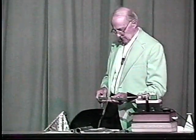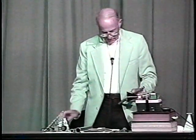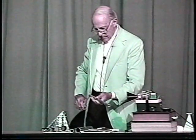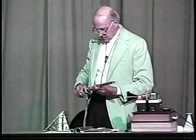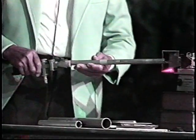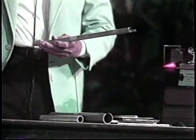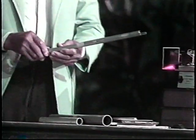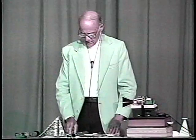Our wave is beyond cutoff for this pipe. But how about putting a plastic rod down through the inside of that pipe — see what happens then. It comes right through. So we have loaded the interior with dielectric; we've increased the cutoff wavelength so the wave goes through. So if you have waveguide and you're not getting something through, just pour something in and increase the effective diameter.